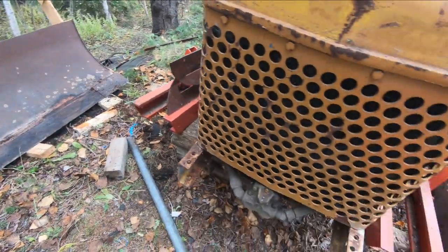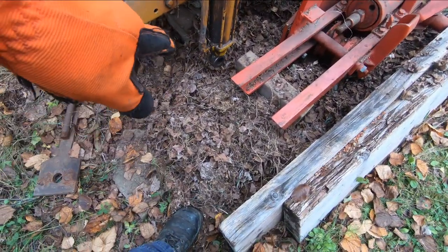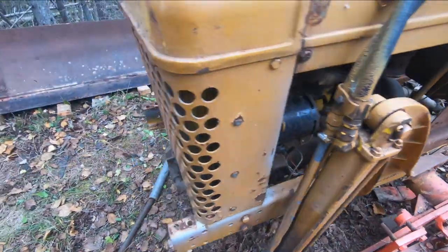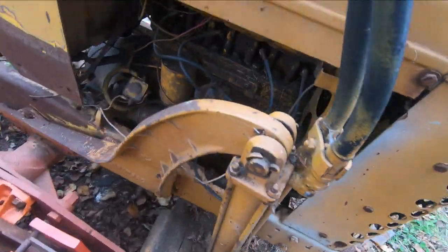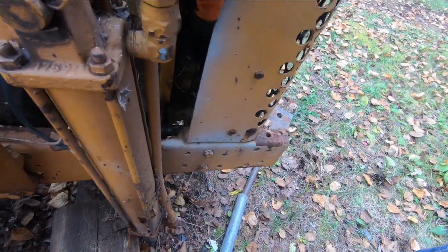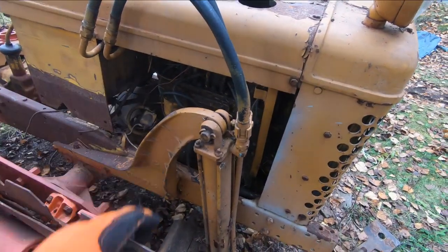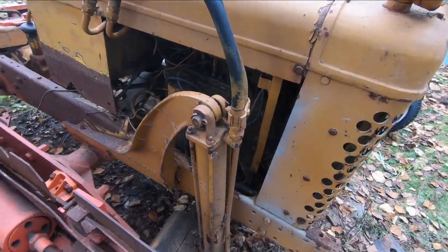But the squirrels had got up under the tarp here and made some nests up in around the engine. So I pulled all that out today. And then I just turned the engine over by hand and it moved. So this is not seized. When I turn the fan belt, the crank turns anyway. So it's not seized. So what I'm going to do is take out the spark plugs and put some oil down in the cylinders. Roll it over a couple of times. And then...